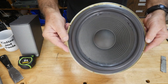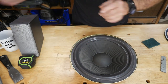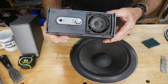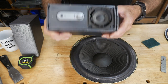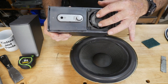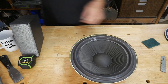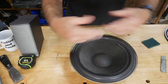This is looking really good — pretty happy with the results. Now, this is the same principle and same problem with this little Bose — it distorts because all the surround holding the speaker in center is blown out. A similar problem, but not really, because this small speaker sort of keeps itself centered where a big 10-incher can wander around a little bit. For now we're going to stop here and let the glue harden up.